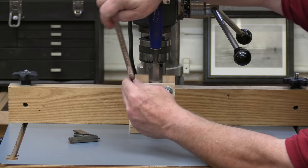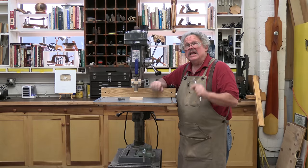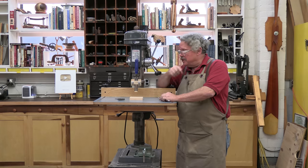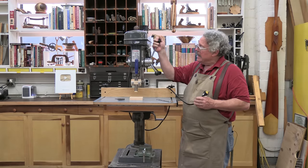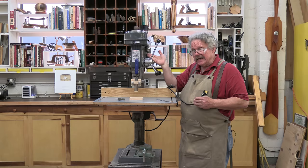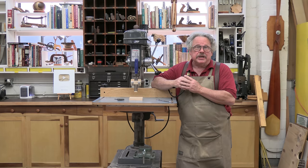Although there are times when you could use just a little skew to help with the cutting. Before we go any further, let's talk safety. Every time you use this jig, you must make absolutely sure that the drill press is unplugged. All you need from this tool is the quill — the up and down part. If you should accidentally hit the switch and turn on the round and round part, things could get wildly exciting and potentially disastrous.